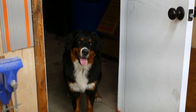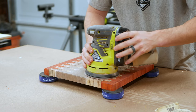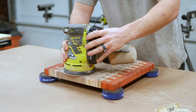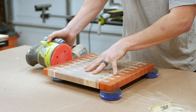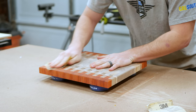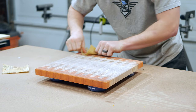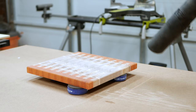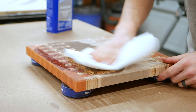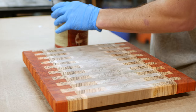At this point I noticed I had an audience who was rather interested in the project. Once the piece dried, I sanded up through the grits using the orbital sander to get all the edges with 120 grit and then did hand sanding with 220 and then 400 grit. I only used the higher grits to sand the chamfers — the orbital sander felt too aggressive for them. I then used my leaf blower to dust off the piece. Before finishing, I rubbed in some mineral spirits to all sides of the piece to help collect all that dust that can gather inside the pores when you use really fine grit sandpaper.